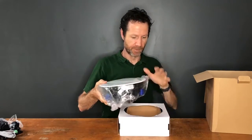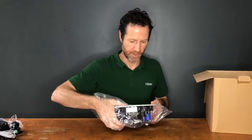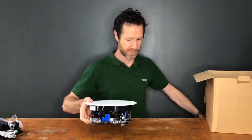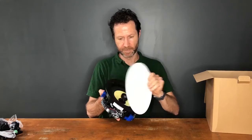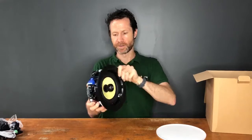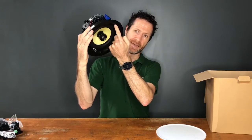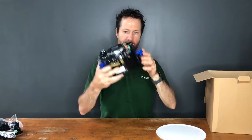I won't show you the slave but both speakers are the same. This has a 2x35 watt RMS digital amplifier built in. This is a magnetic grill — it comes off, and the way you fix these is to cut your hole in the ceiling. Then we have these blue clamps. As you put it up and do this screw up from underneath, the clamp turns and then comes down and clamps onto the ceiling surface. That's how you fit them.